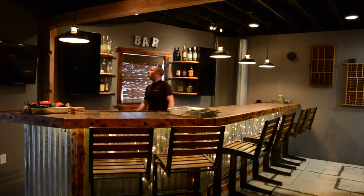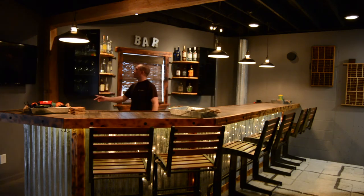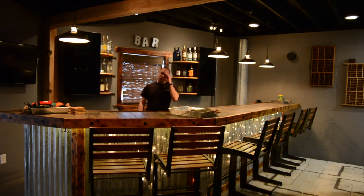The cabinets behind me are IKEA cabinets. If I had to go back and do it all over again, I wouldn't buy IKEA cabinets because they're based on the metric system and not wide enough to catch the 16-on-center studs. I had to mount them outward on both sides to catch the studs, so mounting them was a little crazy. If I had to go back, I would use a regular cabinet from Home Depot or Lowe's and put my own glass front on them. I did tinted glass on the front — these cabinets hold all of my glassware and have soft-close doors.